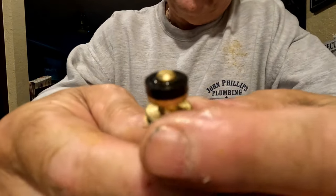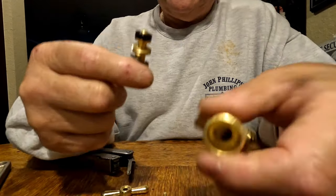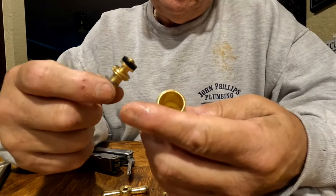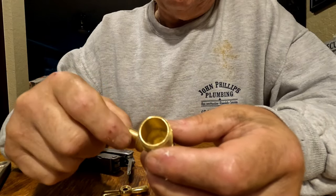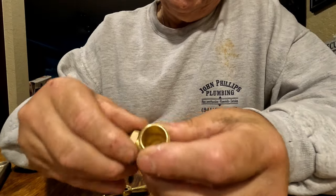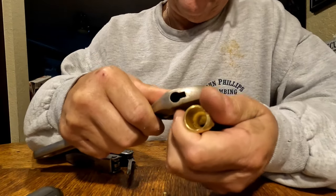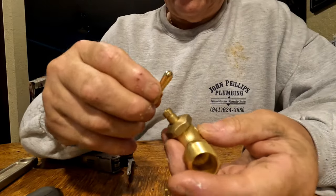It's got a nice little recess in there for the way the seat cuts into this - you can see it stands up tall inside there. I think it's a quality valve and I prefer these over the quarter-turn for sure, just because it's so easy to take apart. Sometimes getting that bonnet nut off of a silcock is hard.